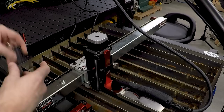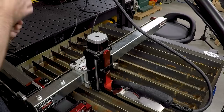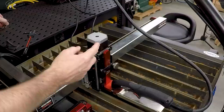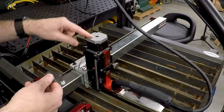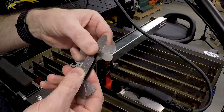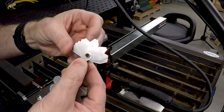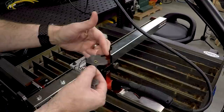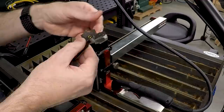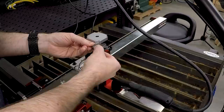In order to get the part to fit the motor, we need dimensions off of the motor. Some of them are really easy — just grab a caliper, get the outside dimensions, get the dimensions of the protrusions on the sides. Other parts, like measuring the curves and radii of the fillets, require a different tool. This is a set of radius gauges. On one end it's got leaves with outside radii, and on the other side leaves with inside radii on the tip. The two and a half millimeter fits nicely on the outside, and the five millimeter outside radius gauge fits inside with no gaps, so I know that radius is five millimeters.